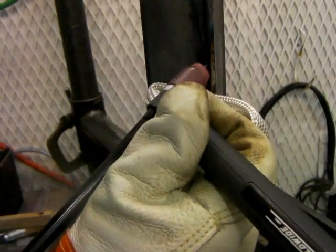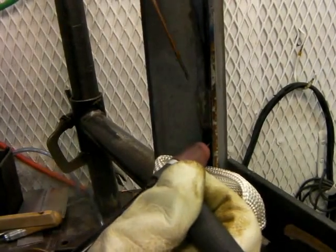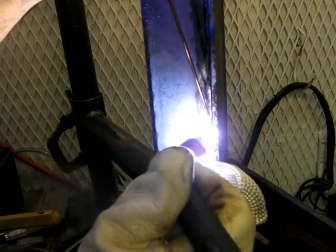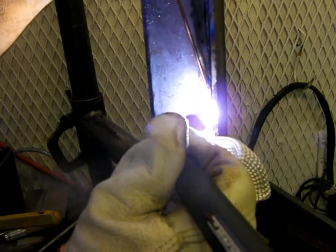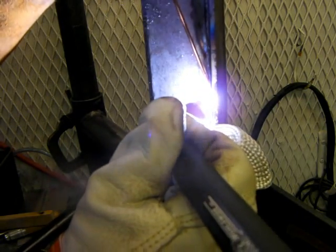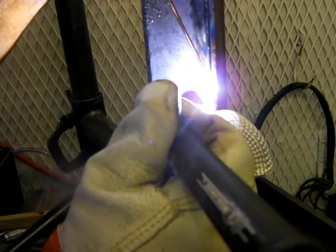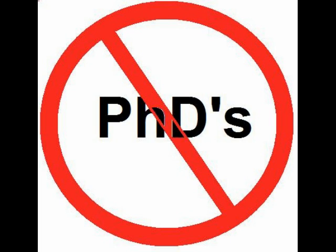Now you could walk the cup on a flat T-joint like this by turning the cup sideways and just wiggling it; however, it's a little bit cumbersome. Walking the cup is generally done more on pipe because the pipe's round and the handle of the TIG torch doesn't get in the way. So I'm using one of my TIG fingers here, propping right next to that weld — the finger never even gets warm. The material is nice and slick, lets me slide right on up. That's a good tip — thanks for watching WeldingTipsAndTricks.com.